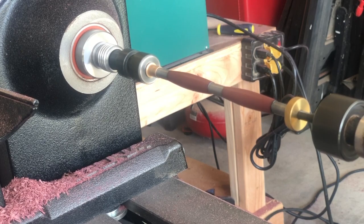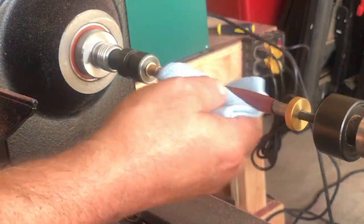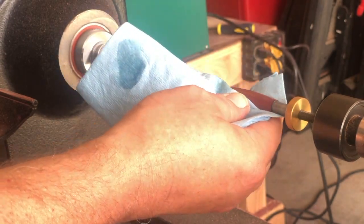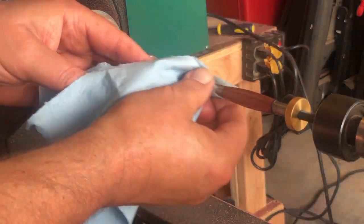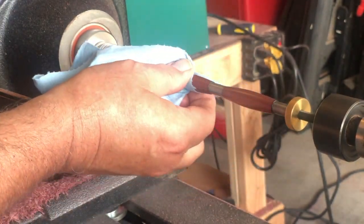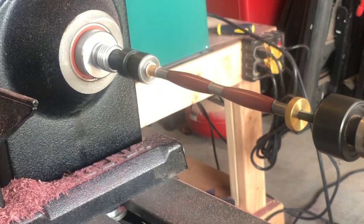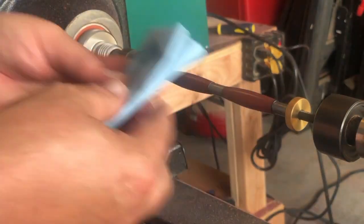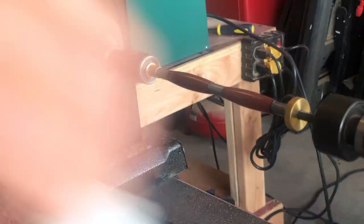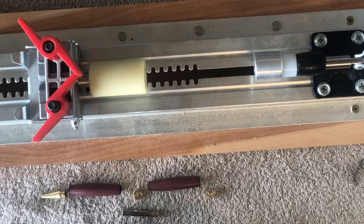And make sure that it's friction polish, so you get that pinched in and kind of heat it up a little bit. Like here I'm pinching it, make sure it's getting hot for it to set. And I think we get at least 2 more coats like that, yeah. Again, make sure that the friction polish, you let it work with the friction. It'll heat up, and then the shine will come out on it. I think this is the last one I do. And again, pinch it up, make sure you got it. And there we go.